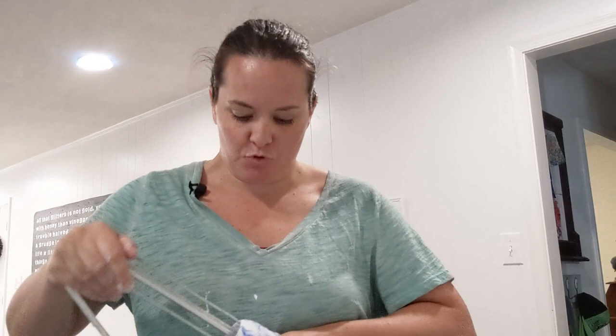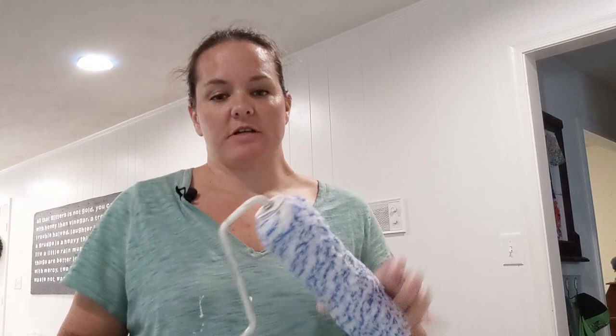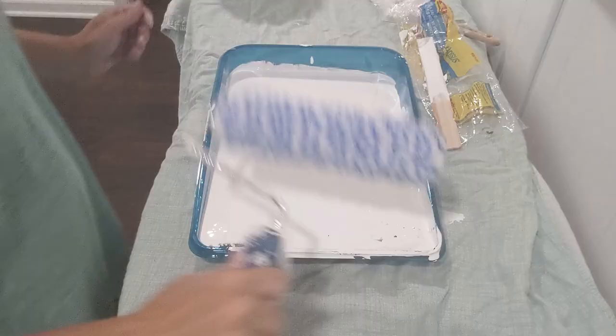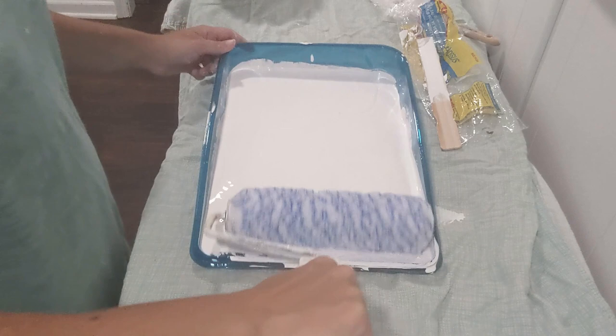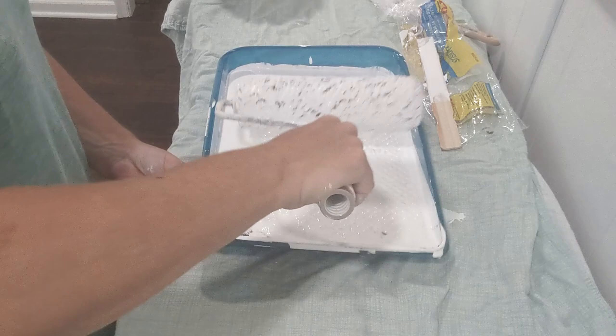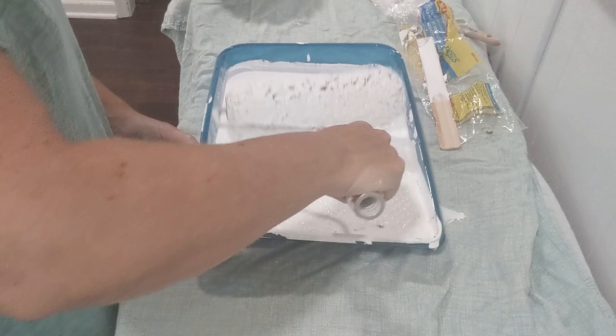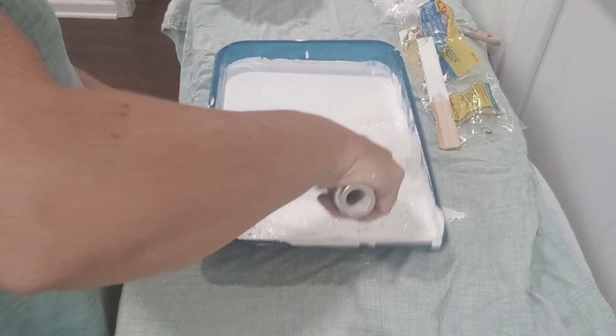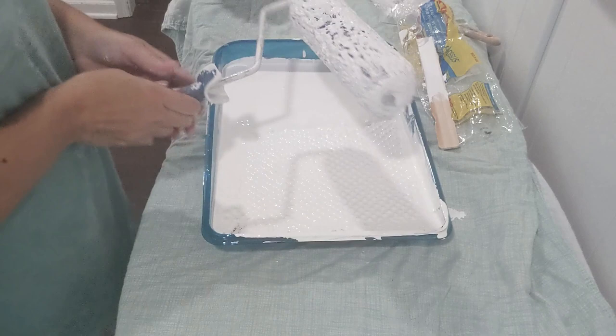I'm using this Colossus roller cover, which is for textured rough surfaces. It's very important if you're painting a textured ceiling that you use a roller specifically for textured surfaces. This has a three-quarter inch nap, which means it's really thick so it can hold a lot of paint and really push the paint into the low areas of the textured ceiling, which will make things go much faster. When you are loading up your roller with paint, make sure that all the sides are covered all the way around, and then roll it at the top part to get off the excess paint. You want your paint roller to be pretty wet — especially with this high nap — to get paint down into all the little crevices and low spots, but not dripping, because obviously when you're painting a ceiling overhead, dripping paint is your worst nightmare.